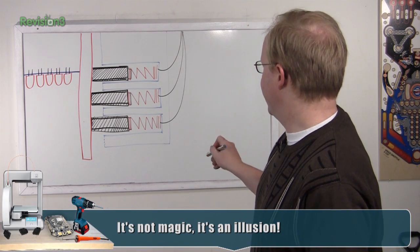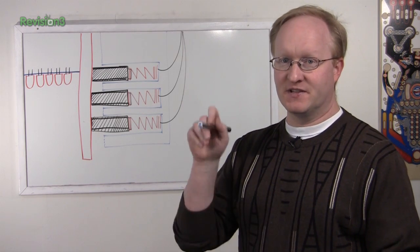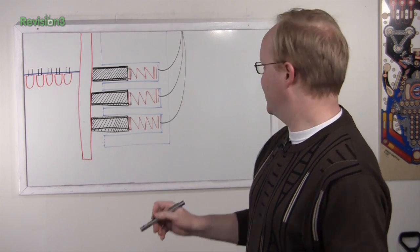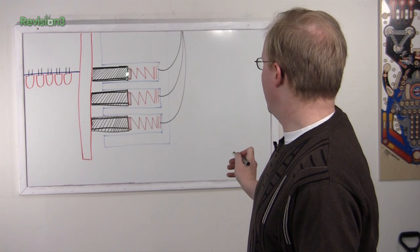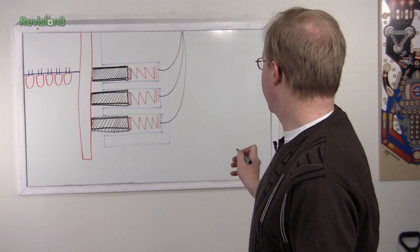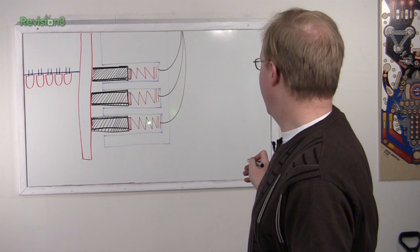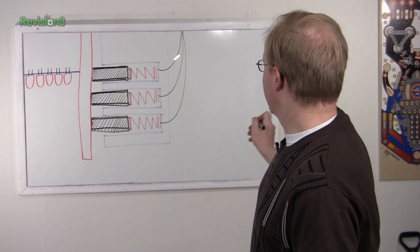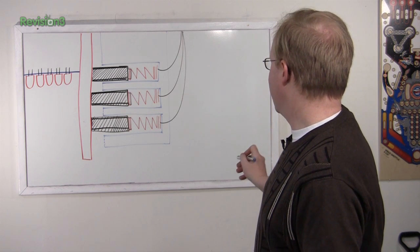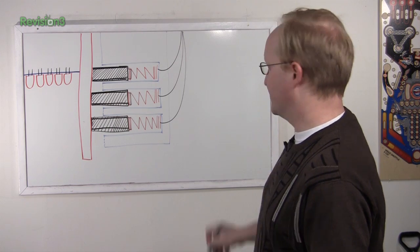This is going to be free spinning — this is the disc. To get power and data to it, we're going to use these spring-loaded carbon brushes. They're small little carbon rods that are spring-loaded and we're going to have them in their own little wells, pushing out against the spinning PCB disc so power and data can be transmitted to the free spinning LED drum.